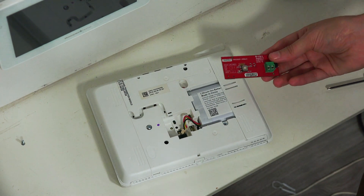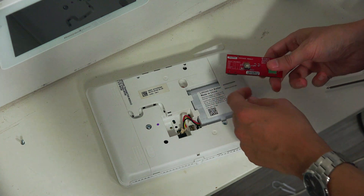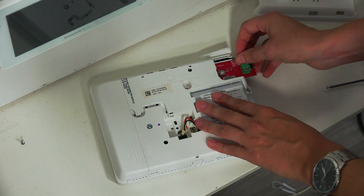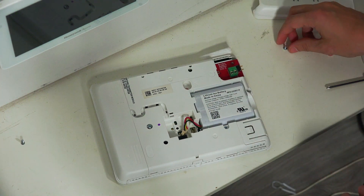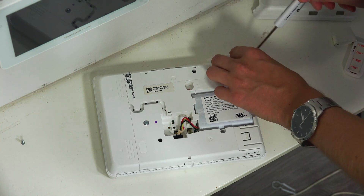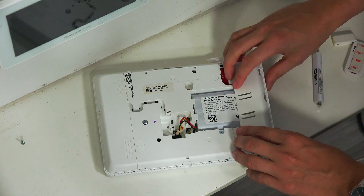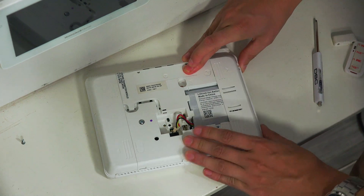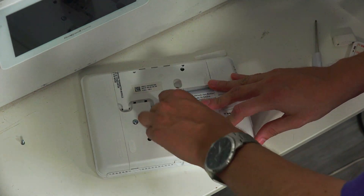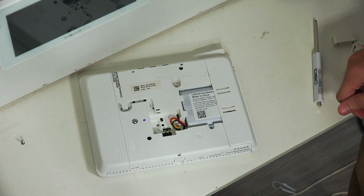We have the Pro A7 Plus panel and we're going to install the Pro Takeover module. It's going to be installed dial side up — this side will be facing up and the other side inserted into the panel. We're going to take off the slot cover, pry that off, and then insert it into the slot. It snugly fits into place. Once installed, you can do the set screw. Remember to adjust the dial before doing that — we did that earlier based on the frequency you're using. Screw it into place and reapply the slot cover on top. We have installed the unit. Now we're going to mount it back on the Pro Takeover backplate. I'll reconnect the backup battery so I don't forget. The system won't power on until it's receiving AC power from the blue terminal block.